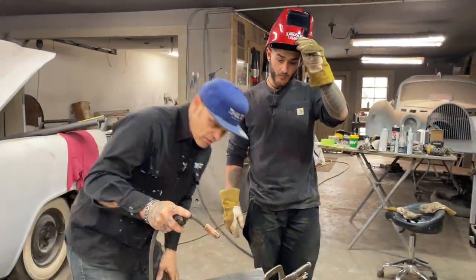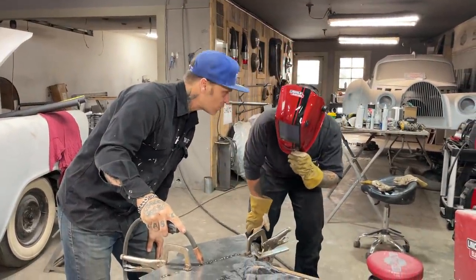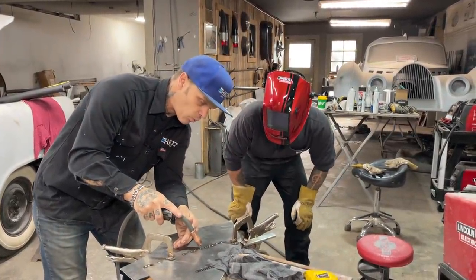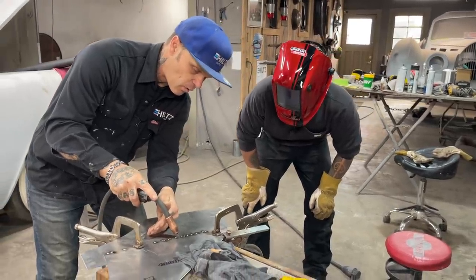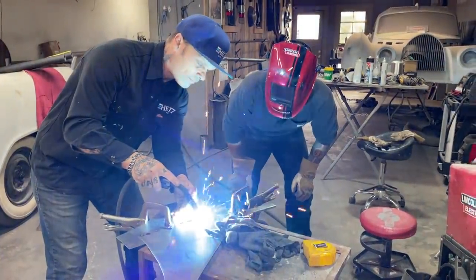So if I went back in to weld it with that distance there, that'd be great. But watch, the wire pushes in, you get too close. Now that I have the helmet on, I can make the adjustment how far away I am and where I'm welding. So see, my wire's not even touching now. But that's how far away I want to be. So with my helmet on, I can do it. I hold it steady enough, close my eyes, and I can weld.